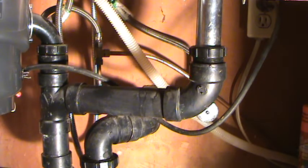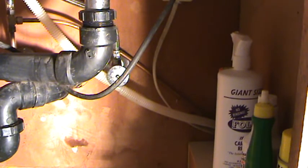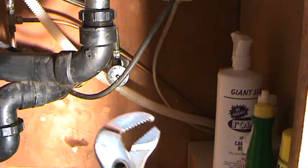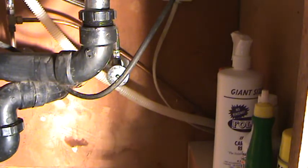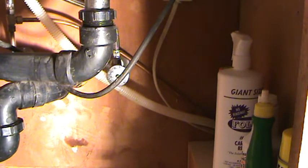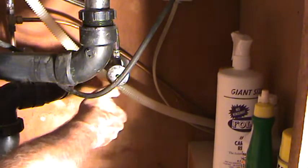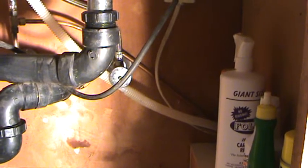If you break it, crack it, or if it's a compression fitting — you start tightening it and maybe it pops off or breaks. So I always shut the water off. On older gate valves, I couldn't even turn it off with my hand. I'm glad I had my channel locks — I opened them up and used them to turn the handle. Righty tighty, lefty loosey — I turned it to the right and kept turning until it shut off. Then I reached up and tightened the nut.